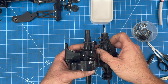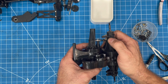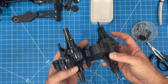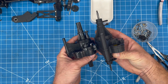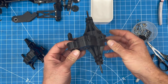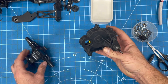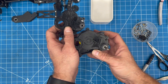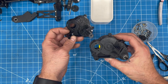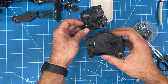I reinforced the shock mounts and put the shocks in double shear so they're supported, spreading out the stresses on the shock mounts. I also increased the width — actually this gearbox is stock width; I have another design that's 30 millimeters wider, but this one uses the stock axle. When playing around with the gearing, I was basically forced to go with bigger gears to get the variety I wanted. So I tried to push the motor back towards the front of the vehicle and flatten it out a little bit.